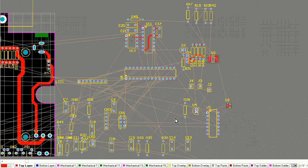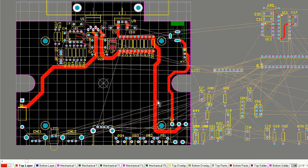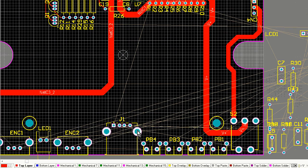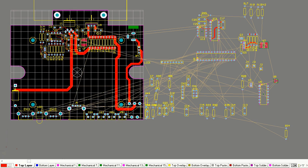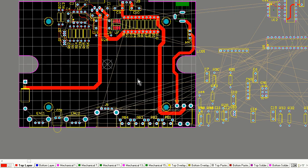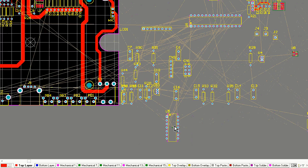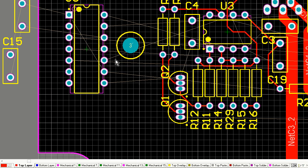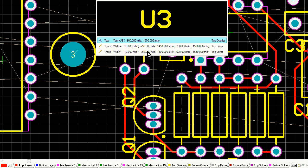See, because I've got those fixed voltage regulators at the back mounted on the heatsink, it makes sense to put the circuitry around the voltage regulators up near the top of the board there, or the back end of the board, which is the top edge up there near the heatsink, because you don't want to have to run traces all the way across the board. That will kill your layout completely dead.